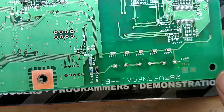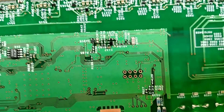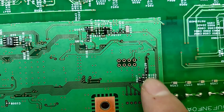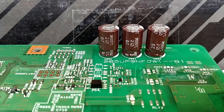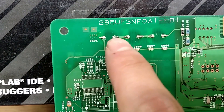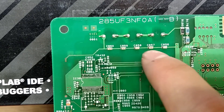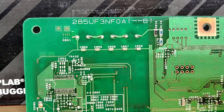This whole section up here is the high voltage sense circuit. You can see the two lines coming in here and across — this is what measures the entire pack voltage. They've filtered it with 400-volt capacitors, but they're all connected in series, forming a bulk filter. Then they have a fine filter here for higher frequency noise. That's what they're using to sense the full stack voltage.